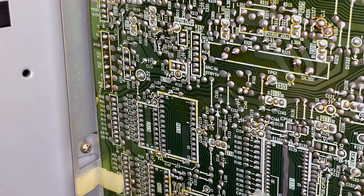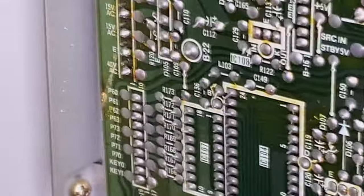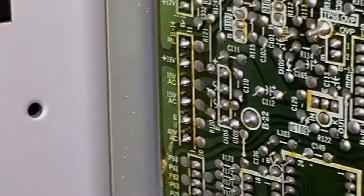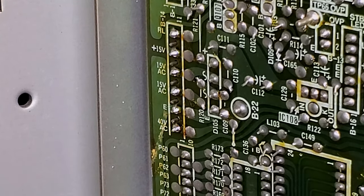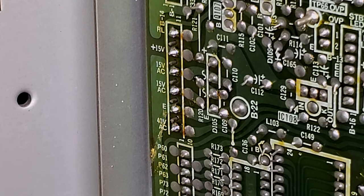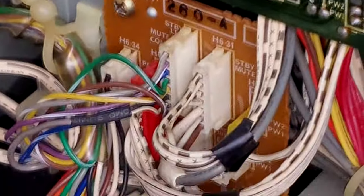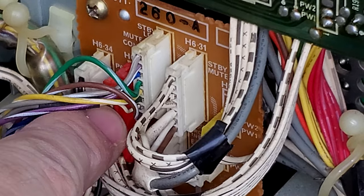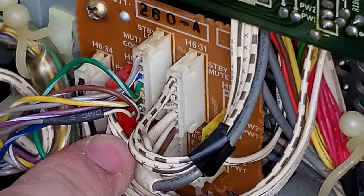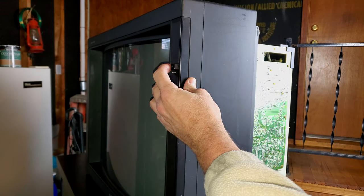So that's our reflowed solder right in there on those points. Let's just re-plug the monitor up, see if it works and see if we can wiggle that point. Our other option might be that the connector down here behind this also needs to be re-soldered.